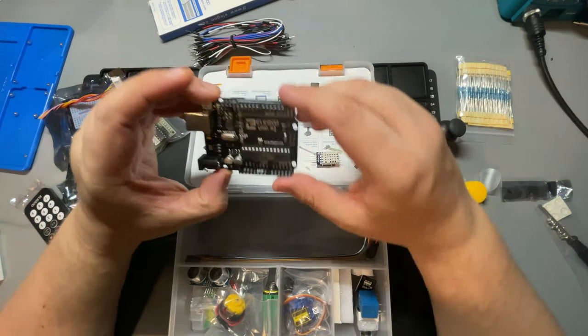So what are we going to do? We're going to put the 5 volts from the Uno onto the positive rail, and then put the ground to the ground, or negative. That makes perfect sense. So we're going to put the negative, the shorter leg, in here somewhere, and then the resistor is going to go from the positive to somewhere. I don't think it really matters where, I assume. Because once that's connected, all of this line is on the same circuit, and then the positive will go to there. So that makes sense, I suppose. It will go from here to here, and then travel up through the resistor, and then the LED back down, and then to ground. Okay, that makes sense. Let's do that.